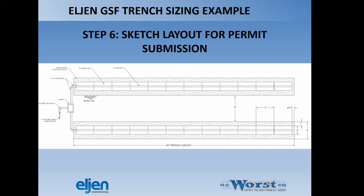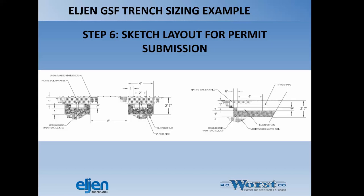And then you can see that we have 6 foot between trenches, which is required by the state. We've got a 4 foot wide trench with the Eljen in the middle. We got 1 foot on each side because the Eljen product itself is 2 foot wide. And so that gives you a pretty good idea, 49 foot trench length there for the total length of each trench. Here's a side view, and you can see how this lays in.